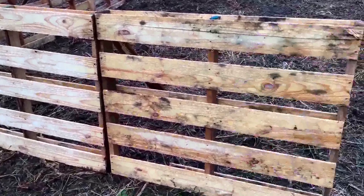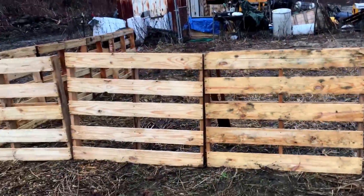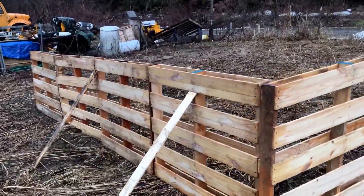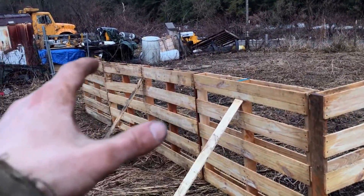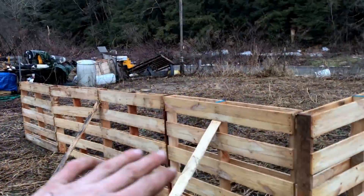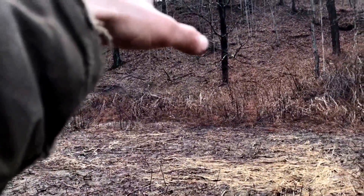This side of the panel is gonna come off, and I'm gonna put the siding all the way up. I'll probably do wall sections and then have a bunch of guys help me carry the wall sections over. I'll have a 16-foot section - I'll put together the first level of the 16-foot section and then have a bunch of guys carry that over to this spot on the hill. We'll level that out with a bulldozer. Then for the second floor, I'll probably do two four-foot sections - two eight-foot sections - carry them up and prop them on top.